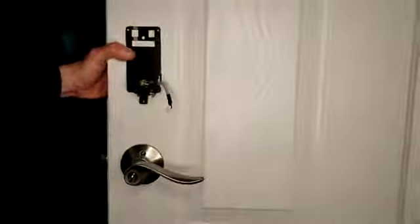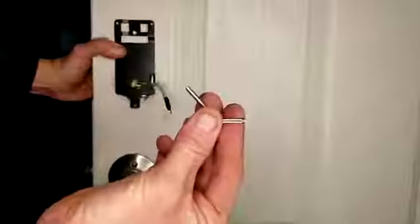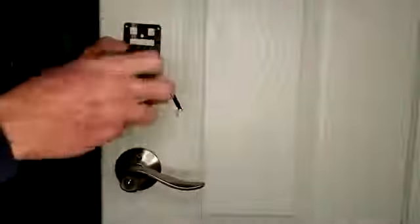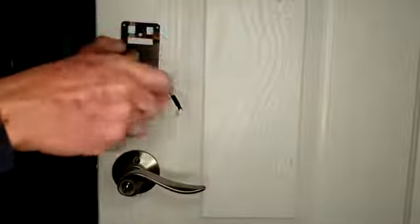Make sure your wire is off in the little slot, then insert your two tabs into the below silver section. Again, make sure your wire is off to the side. Then use a couple of sets of longer screws for your door thickness and screw that in on both sides — that holds the bracket, and then the interior portion goes over the top of this. If you did do that top bolt with the drill, it would go right through there.